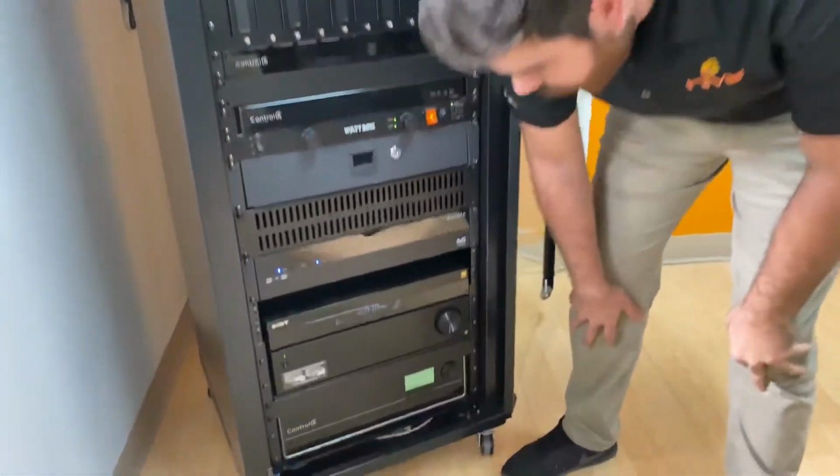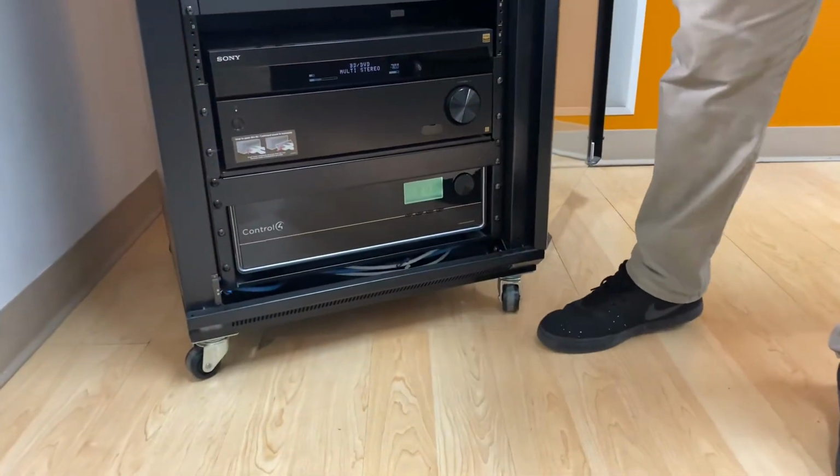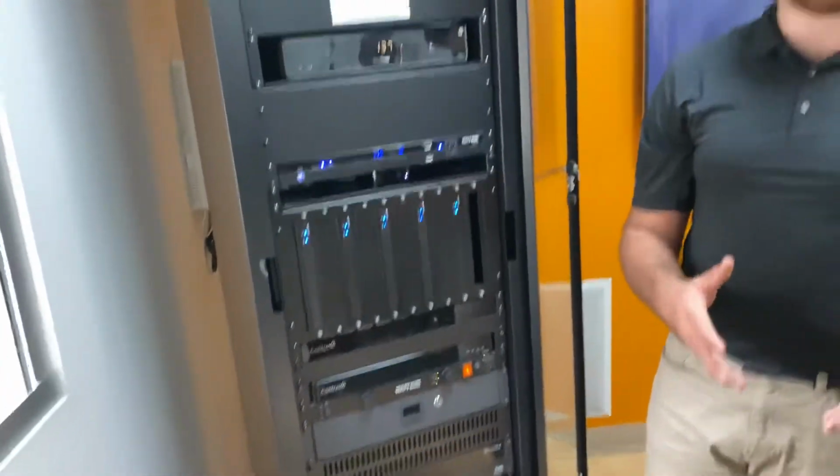We then, down all the way at the bottom there, that is our amplifier, also known as a Control4 matrix amplifier. Now, this provides the power for your 2.0 areas. So if you have master bath, lanai, office, anything that just has 2 speakers in it and is getting stereo, goes through a matrix amplifier and does not go through a Sony AVR or audio video receiver. The receiver handles surround sound. The amplifier handles only 2.0s in the areas.